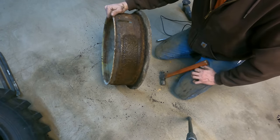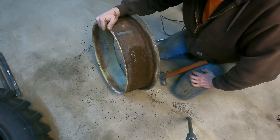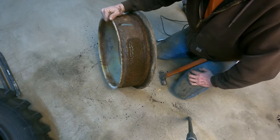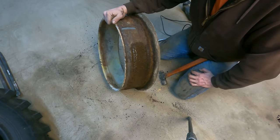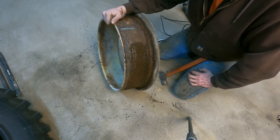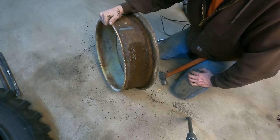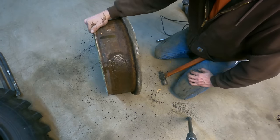There's a lot of hysteria out there about multi-piece rims, split rims, you know, there's lots of names for them, but basically they are very dangerous if you're an idiot. If you don't pay attention and the ring isn't engaged properly and you start putting air to it, yeah, it's probably going to fly off of there, and it has killed lots of people. But if you use your head and be cautious, they're really not that big a deal. And once they have air in them, they're fine. It's just the airing them up part that can be dangerous.